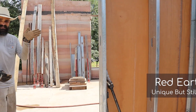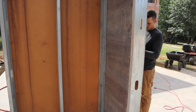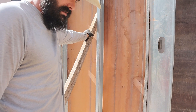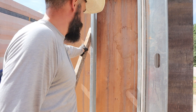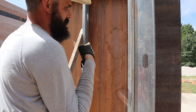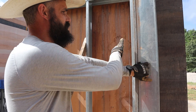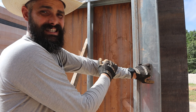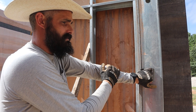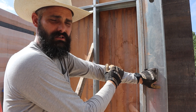What we did was set them up like a fan blade. We started with this one because it has the turnbuckle on it, set it up to that edge, then did this one, then that one, and then we're going to do the other one. It's kind of like a fan blade that allows us to use four-foot wide forms to make an 18-inch square column. A little bit unique, but pretty much all the same stuff — just creative form work.